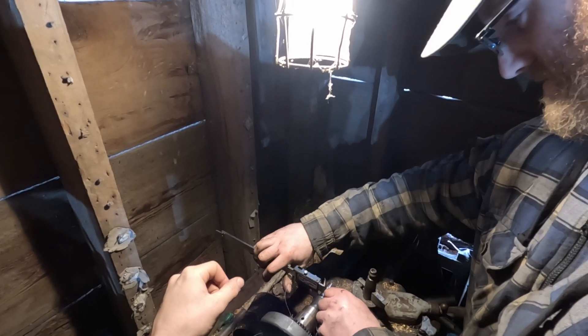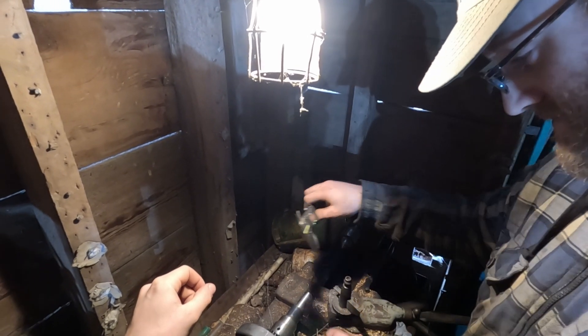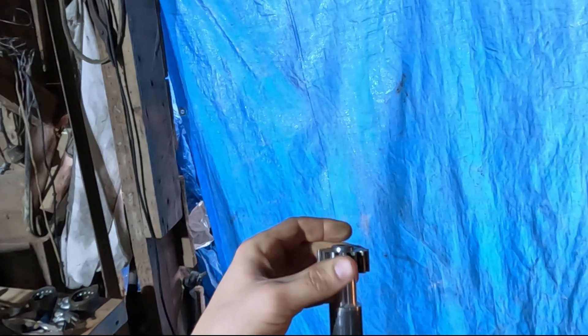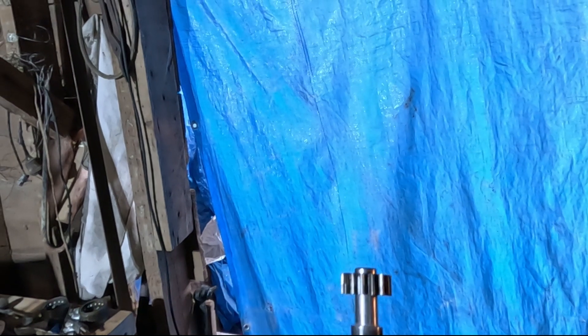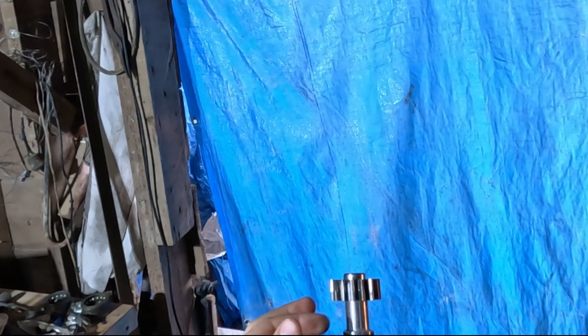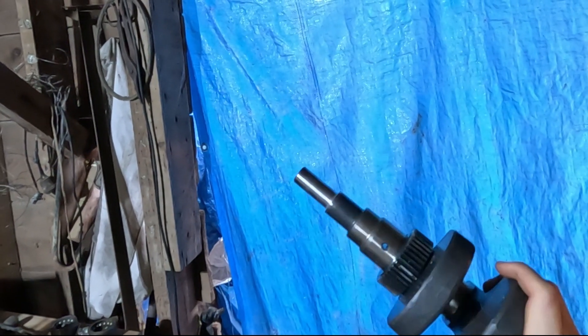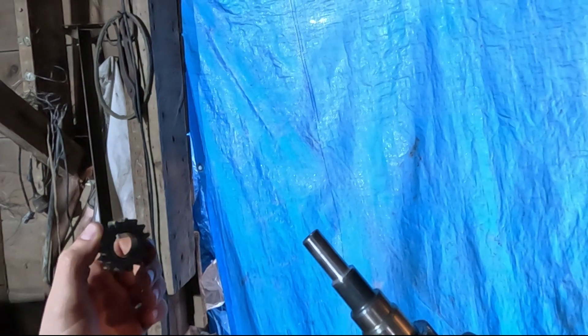So be careful if you're planning to rip it all the way down to 0.75 — take special care not to overdo it. It doesn't go quite on at 0.75 but the slightly larger diameter in there makes it super nice. We don't have a keyway yet and I'm feeling cheap, so I'm just gonna Dremel in a keyway. On the original one the keyway grabbed a lot of it, so that's where a lot of our press fit comes from.